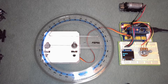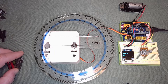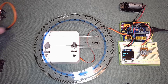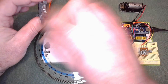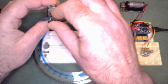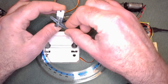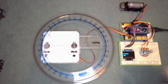The first thing is when you are actually fitting these servos to Otto and looking for alignment and centralization. As you see in Camilo's videos, once you've got the thing set up it's best to put the servo at 90 degrees, then pop the horn on and check that you've got 180 degrees of rotation. Then you centralize.